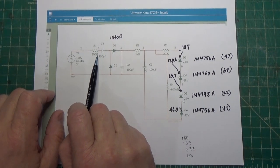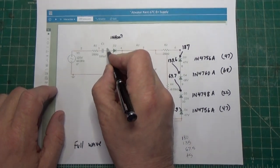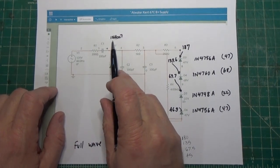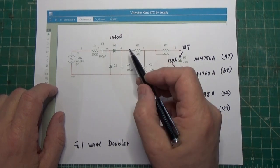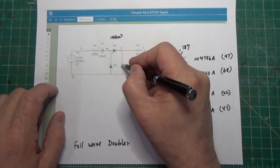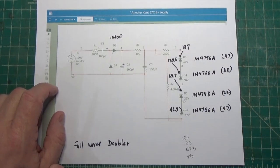come right here to a capacitor. It's an electrolytic capacitor, 100 microfarads. And your plus side goes to the diodes. Okay, here you have two 1N4007s, one here and one here. Okay, and then you come to another 100 microfarad electrolytic cap. Plus is here, and this right here creates a full wave rectifier essentially.